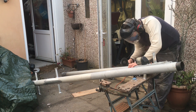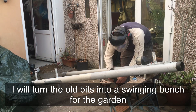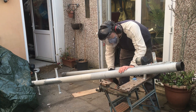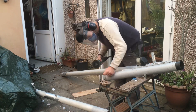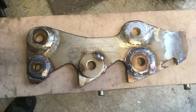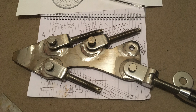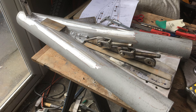It is now time to cut apart my old friend the mast top — I hate doing this type of job, but sometimes you have to destroy in order to create. I'm reusing the top of the mast with the navigation light on it, and I'll be welding all of this onto the top of the two new five-meter poles. I'll be putting an internal sleeve in to add strength back to what is essentially a heat-affected zone, so it will be stronger than the surrounding aluminium. The rigging attachment points going through the top of that mast section will be stainless steel — one piece of stainless so the rear wires are attached directly through to the front wires with no joints. That strikes me as a much more solid, strong design, and it was a little bit lighter too — which is good because you want to reduce weight on the top of the mast.